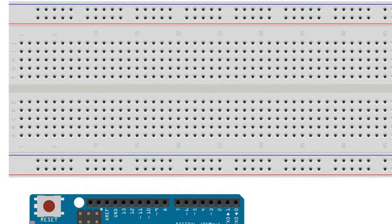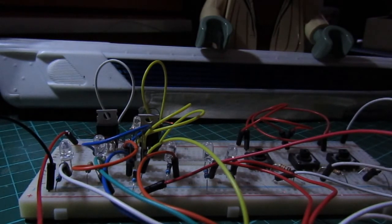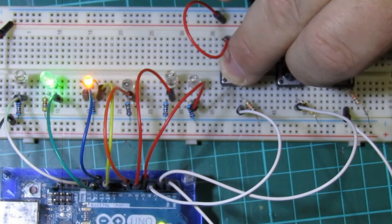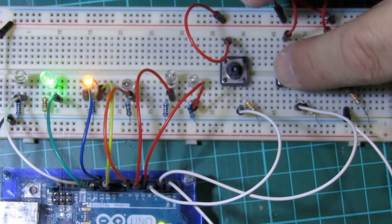In the final part of this segment we'll be adding sound effects to our Starship prototype board. Unfortunately the Arduino Uno needs to use pins 9 to 13 to access the SD card adapter, which means we need to move things around a little, so we'll be wiring up the breadboard from scratch. On a positive note we'll be losing the annoying strobe light flicker at the beginning of the sketch, as the strobe lights were originally connected to pin 13 which flickers when the ATmega boots up. On a negative note we no longer have enough pulse width modulation pins for our photon torpedo effect, as the SD card adapter relies quite heavily on these.